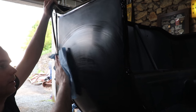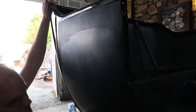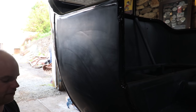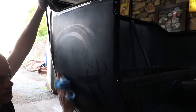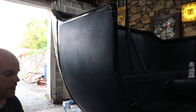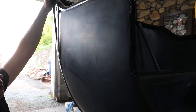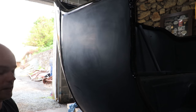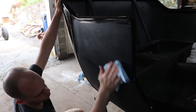The one thing also to note is that you really shouldn't be listening to loud music or have headphones on when you're doing this, because you need to hear. You can't always feel. You really need to hear the surface. If you hear any kind of higher pitched scratch, it's actually contaminants between your sandpaper and the surface. So it's all about cleanliness. You can pick up dirt, and then by sanding, you're grinding it into the surface. So you really have to be careful.